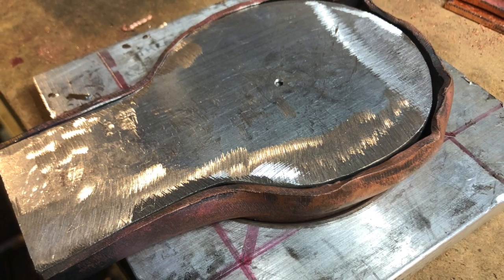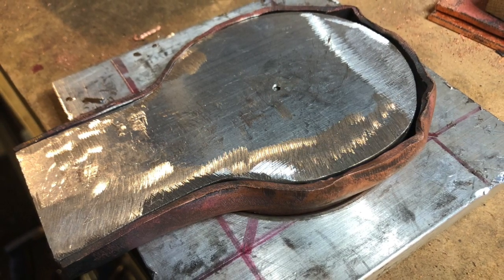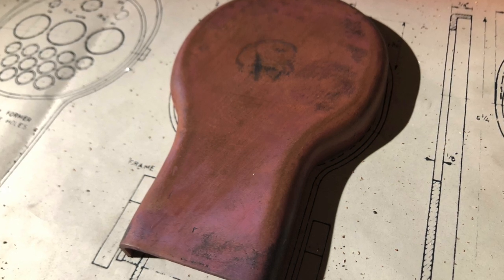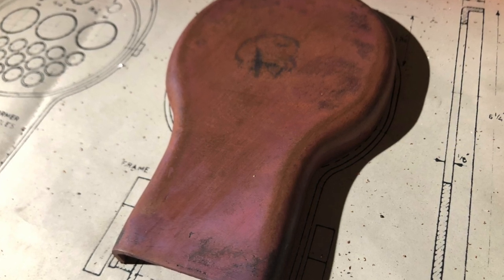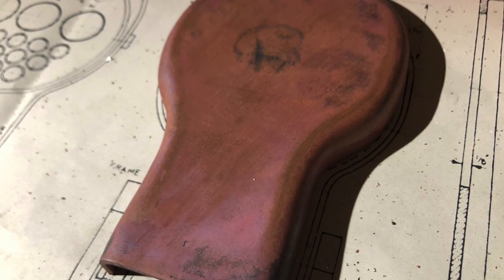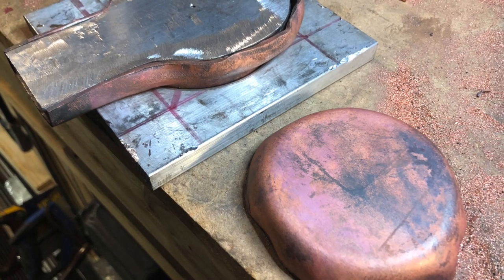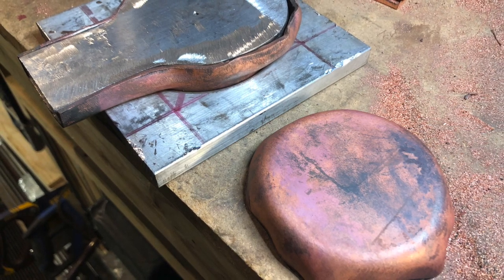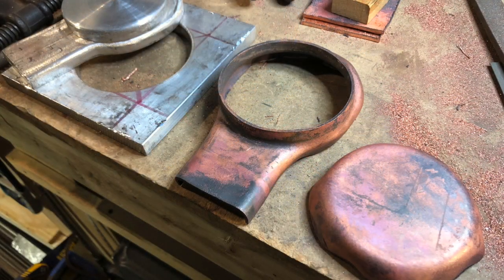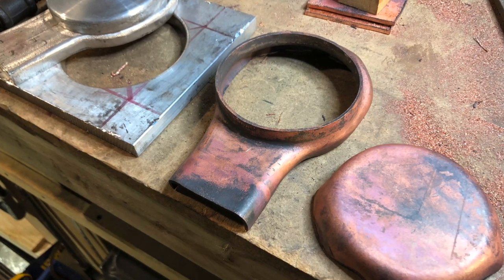You can see there's a little bit of a gap there but it's quite a good fit - it doesn't want to be too tight because the silver solder needs to be able to actually get in there. If it's too stiff then you won't necessarily get a sound joint, and that's something that Alec Farmer makes very clear in his book on boiler making, which is an excellent how-to on the craft. That's the backhead - I've just got that laying on the plans there just to ensure that it's the right profile. Quite a bit of work in that. Same with the smoke box tube plate - they're both coming together there as you can see.